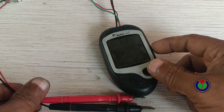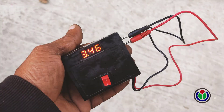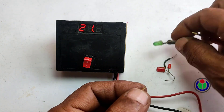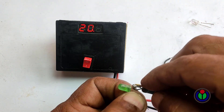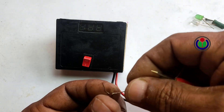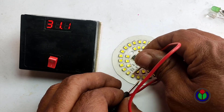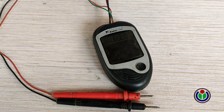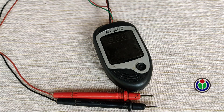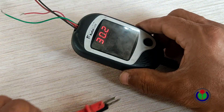This is the module I made with my own hands. With this, the voltage of all types of LEDs can be checked. I have fixed it here at 30 volts — when checking any LED, it supplies a maximum of 30 volts from two probes, but it supplies the specified voltage to the one on which it will be applied, so there is no chance of anything getting damaged. The video has been uploaded on my channel earlier and I have given the video link in the description. I supplied 5 volts to the module with a mobile charger, which was upgraded to 30 volts.